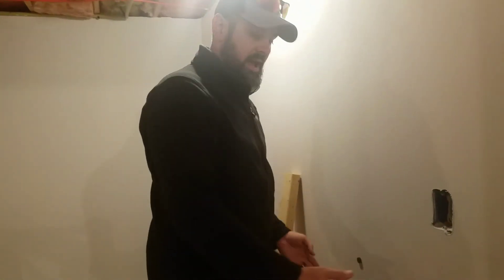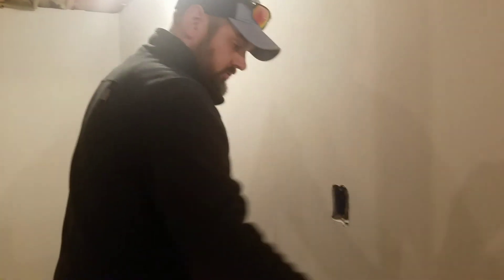When I go to mount my cabinets, every 16 inches I know that there's a stud and I'll drill my cabinets into those studs. You can do the same thing if you're hanging a shelf or something like that. And that's how you find a stud.